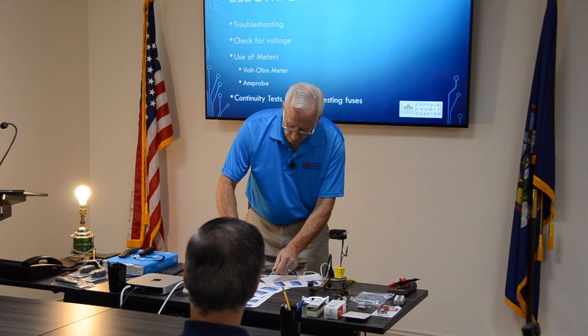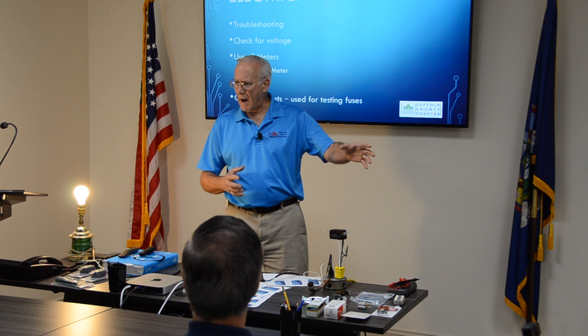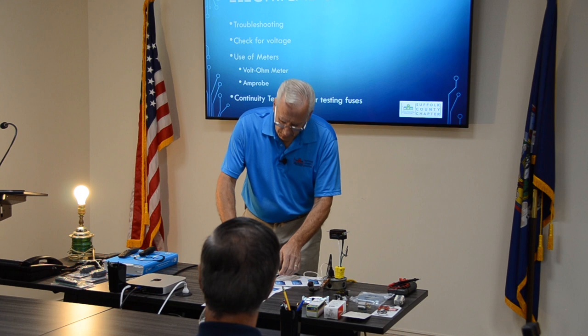That's light works. No problem. You unplug the bulb, the light goes out, right? No problem. But we have a broken neutral. And where do we get a broken neutral? We get broken neutrals in junction boxes. It's a loose wire, the wire nut falls off, whatever. Or underground in a concrete floor in a classroom, they rot out and the wire lets go. I've seen it 100 times. So we have a broken neutral.